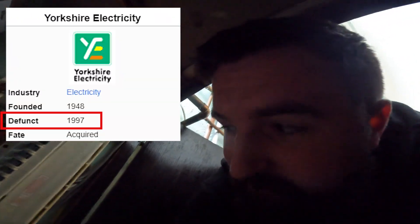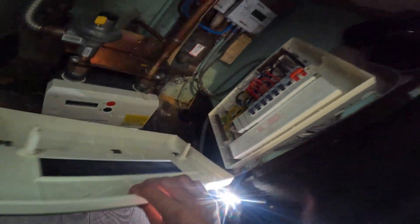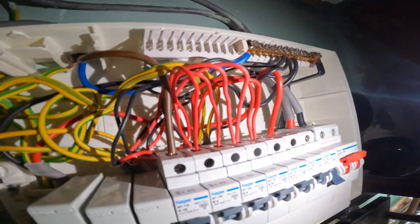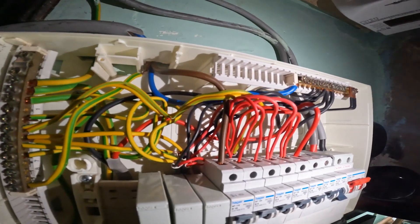The cover's falling off my head. Right, let's get on my side. There we go - we're in. Can't see it without getting on my side. Look at that - the guy would have had to just lay on his side. So a fuse board, and there's no RCD protection on all your circuits - that's an issue. At least for sockets and circuits in the bathroom.